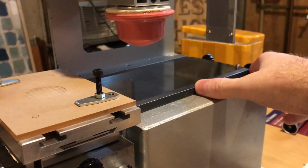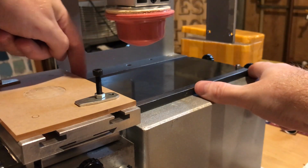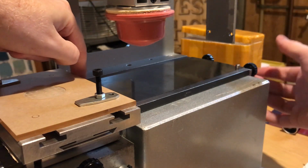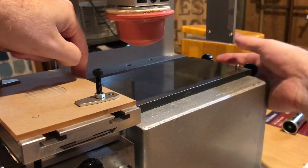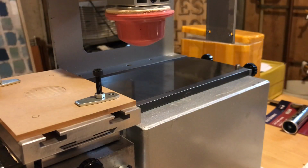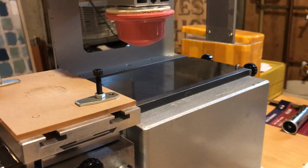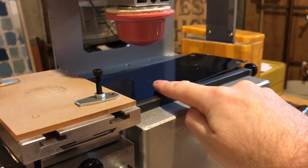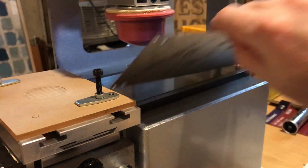Okay, so that sits in there. Again, I keep it flush toward this corner over here. That's just how I've got my setup done. There are screws back here that can tighten to keep that nice and secure on the surface of the pad printer. So one thing is the surface for the plate. Again, I can have a plate which I can put on here that has etchings on it, and it will sit on this surface like so.